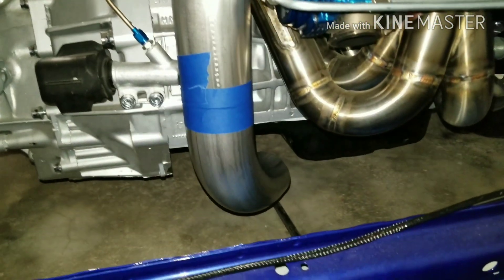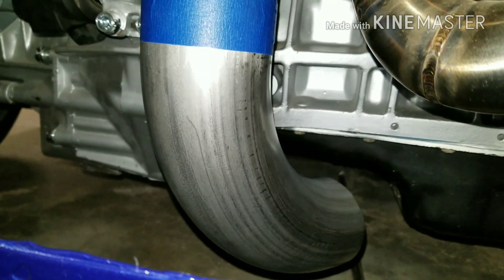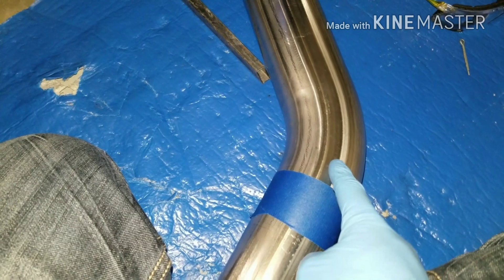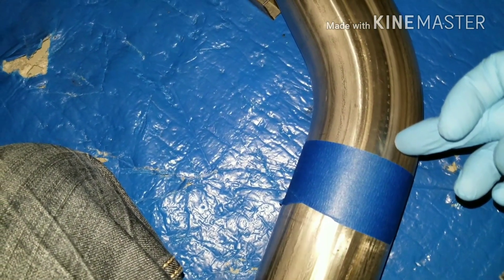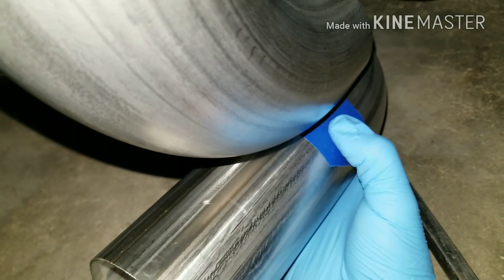So I can see how it looks - the angle looks like it's really close to the oil pan. I'm not sure how I'm gonna do this but I'm just gonna go for it. I might have to cut this piece a little farther inward, but that might send it into the start of the turn which would angle it down and I don't want that. I probably need to cut this piece about a quarter inch towards the bend and that might get it pretty close.